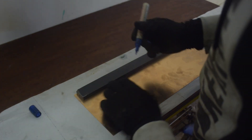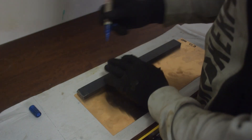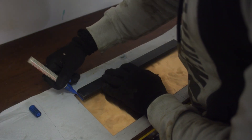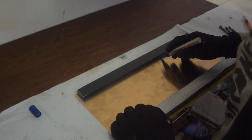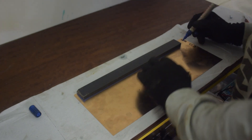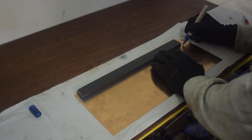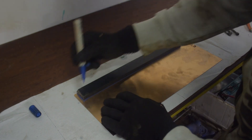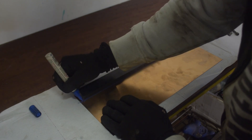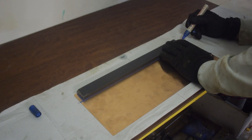Now I will try to do what I said at the beginning. I bought this sheet of phosphorous bronze. I noted that this material has good bearing properties and I wanted to put a thin layer of it attached where there is friction. In this way, potentially, the sliding may be more fluid, and since the guide is harder, the only part that will wear is the bronze, which is a really cheap part in this case.